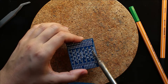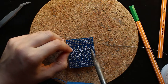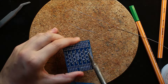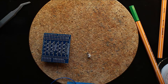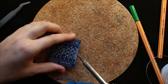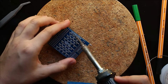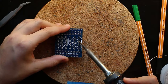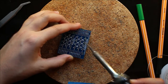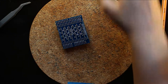To unsolder them, you have to get all of the leads hot at the same time. So the thing to do is just add a blob of solder, and he'll fall out. And then we have to clean the holes. To clean the holes, we take our soldering iron, leave it on them, and then hit it on the table, and they come out clean. We do that for the other two, and a little bit more for this guy. And now they're clean. And then we put in a new LED,